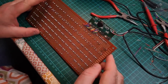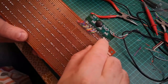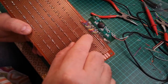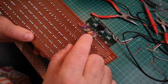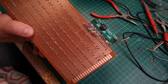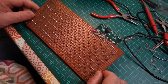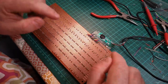Okay, well, that was not a soldering job I'm tremendously proud of, but it's done. So I've transferred all of these tracks here onto traces on the PCB. I've had to offset them a little bit here because I ran out of space, and I had to start using thinner and more flexible wire because the pitch on this board is smaller than it is on this one. This cheap perf board is very, very easy to lift traces on, actually, if you put the soldering iron on there for too long. So anyway, the next thing to do is going to be to test this,